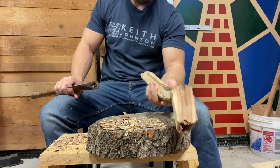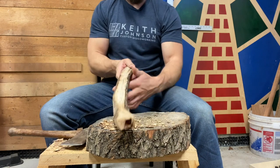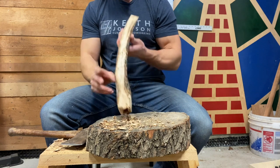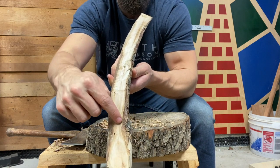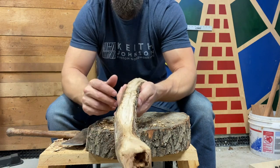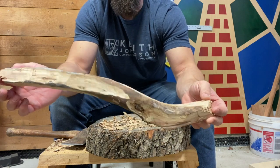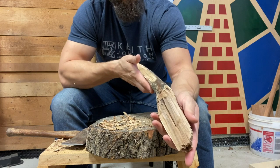I've got a little bit of a left hook in this piece of wood, so I'm thinking maybe this is a right-handed spoon because of the curve. There's also a mild twist in it — this line runs from this corner and then across the face — which could be an interesting design feature. I might actually keep that and emphasize it. The whole point of this exercise is to look at the wood and be in communication with the material while figuring out what the form is going to be. It kind of reveals itself over time.